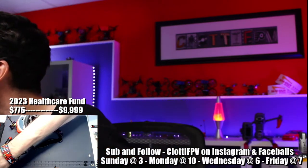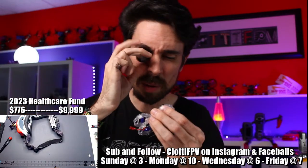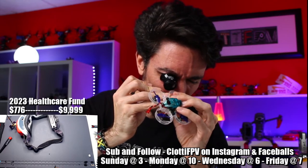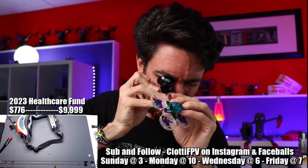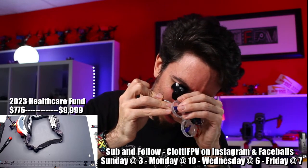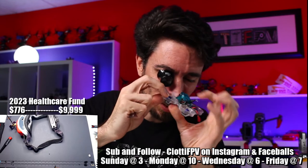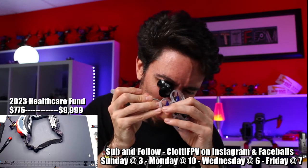So now I'm going to take a set of tweezers and I'm going to go pirate mode. I just want to push the PCBs that I smashed upwards with these longer screws back down against the stator base. Because when I push them up, they push the windings up into the bottom of the motor bell. And that's why those two motors were not spinning. This is what I had to do last time as well. It sucks, but hey, it worked last time. Hopefully it works again this time.